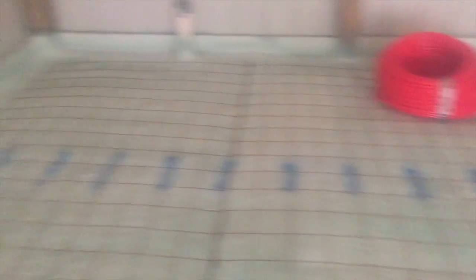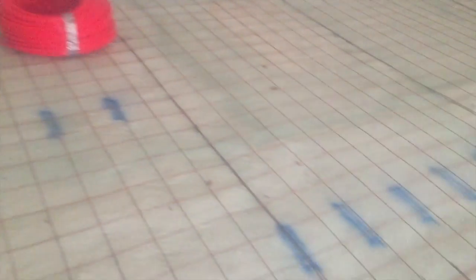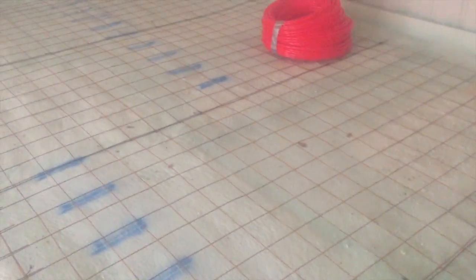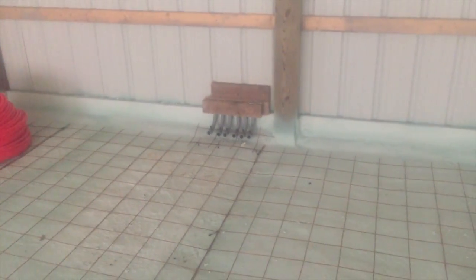I painted some lines on the floor here. This is gonna be one section of tubing, this will be the second section which goes across the drain, and then the third section. Each section is ten feet, giving us an even amount of tubing so that when you lay out the tubing your loops are all exactly the same length. We're gonna come out of this header.